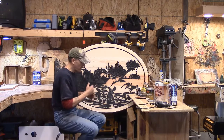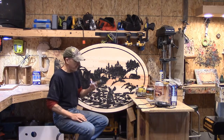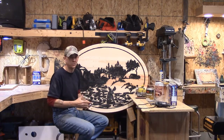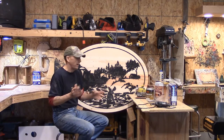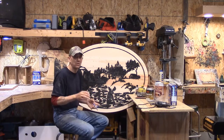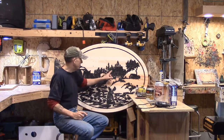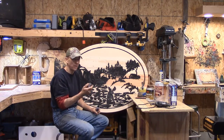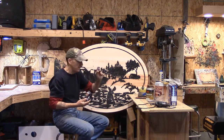What I did Saturday was put two coats of airbrush paint on it. I'm no airbrush authority — I bought a Paasche Talon, a double-action airbrush made in Wisconsin. I try to buy American whenever possible. They're very versatile with different size tips for different spray patterns. The only thing I'm interested in is getting black paint into the engravings. I use Createx Wicked — it's an acrylic enamel, very strong paint. I mix it 50-50 with the reducer in the cup, give it a quick shake, and start spraying.